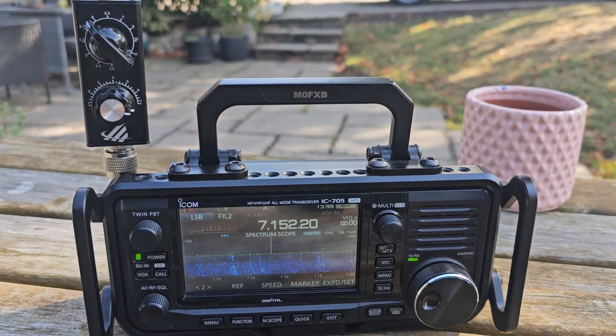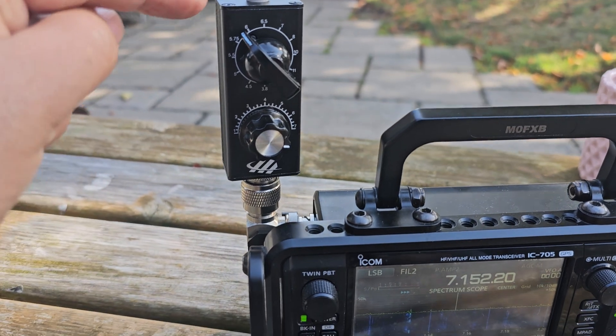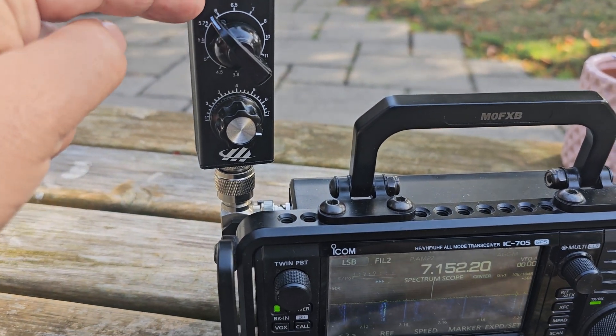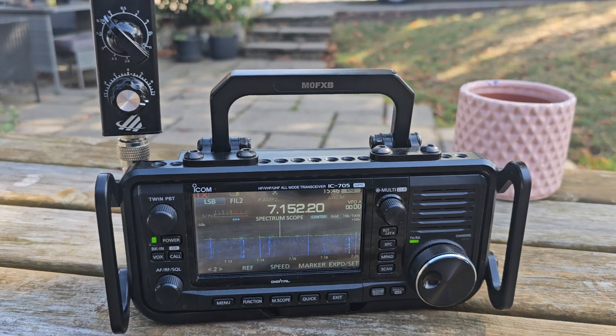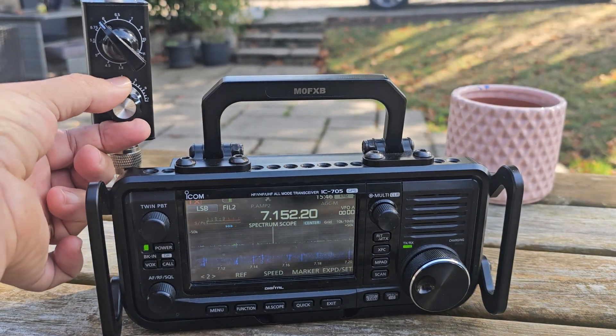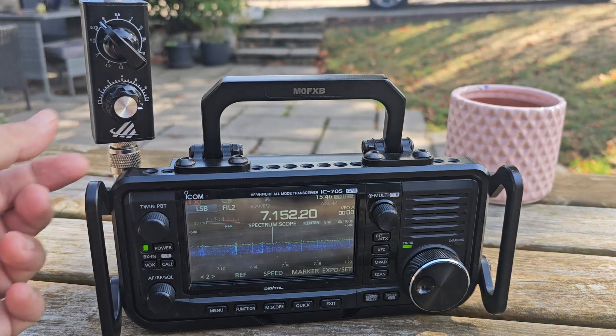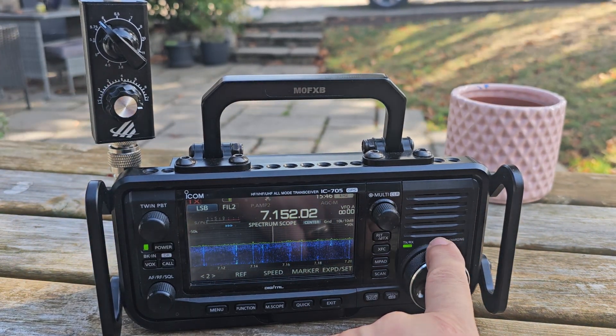The way I've tuned it for 40 meters — if you look here, I've flicked it to between 5.75 and 6, and then you just tune this knob and you'll see it goes quiet. They are designed for transmitting as well, though I'm not going to try that at the moment.